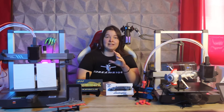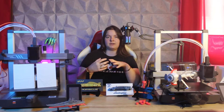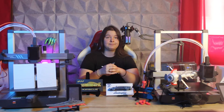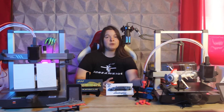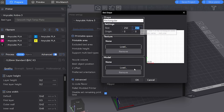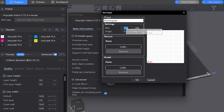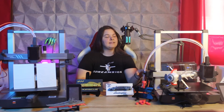Regional leveling will also soon be available for this machine, meaning we will have the option of having the machine do the leveling before printing only on the area that will be used for that particular model. In this way, we will save a lot of time for print preparation and have a more accurate first layer. Speaking of the printing plate, it is not a difference that jumps at you, but the Cobra 3 V2 offers a slightly larger print volume than the V1 — there is a gain of 0.5 cm on both the X and Y axis. This was a software-level change, so the physical plate is the same as the V1. It doesn't seem like much, but in situations where we need to print something large on a tight budget, this really makes the difference.